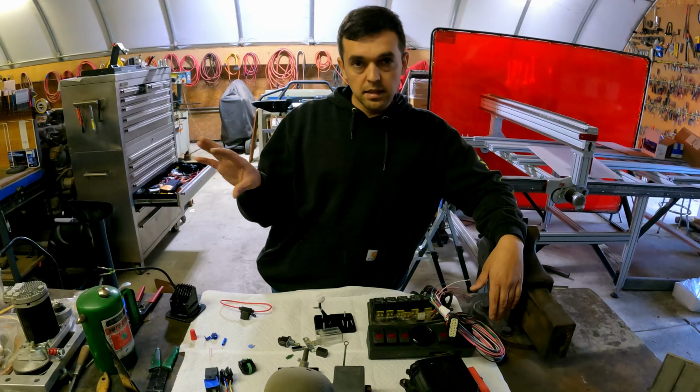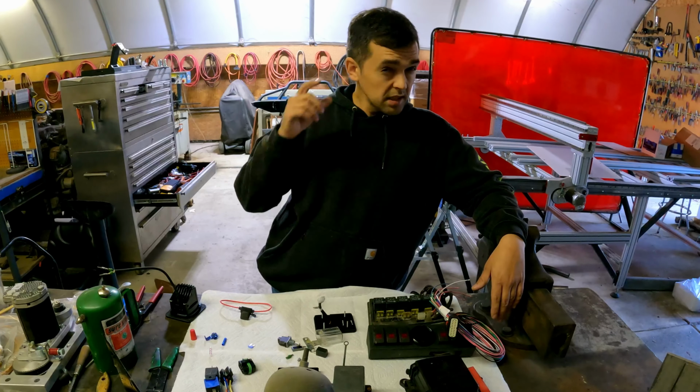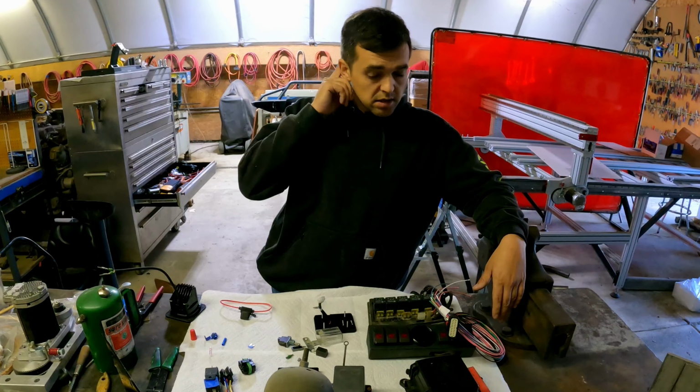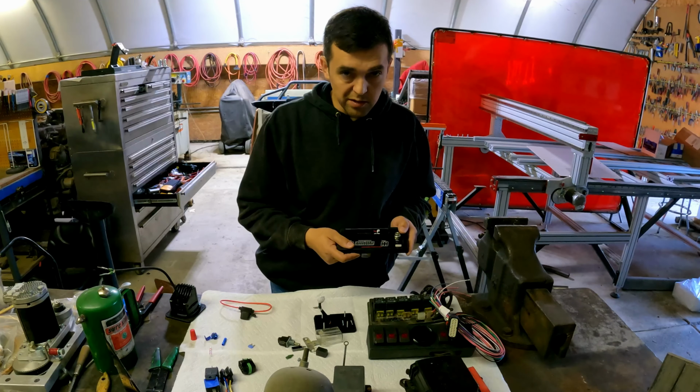All the wiring that I did, all the lights on the other forklifts, they're all solid state relays. They're not as complex as this, but these didn't exist back then. So it's all solid state, but they're all individually wired. So this is a no brainer because it's much easier on the wiring and it's all in one place. It's very controlled how power is distributed. So instead of having all of this, I can just replace that. This has 6, this has 17. I mean, it's a no brainer.